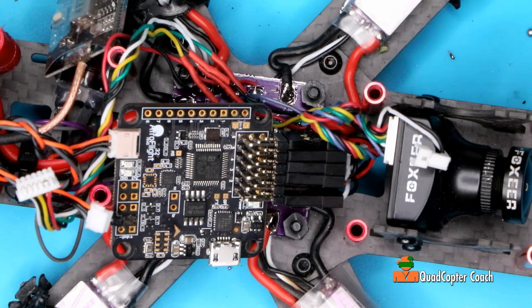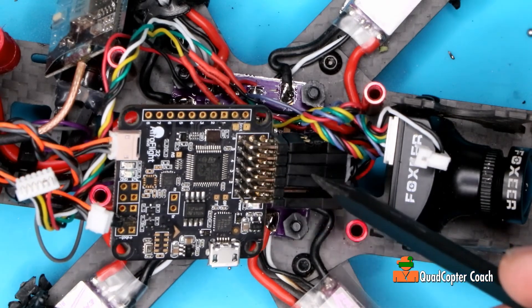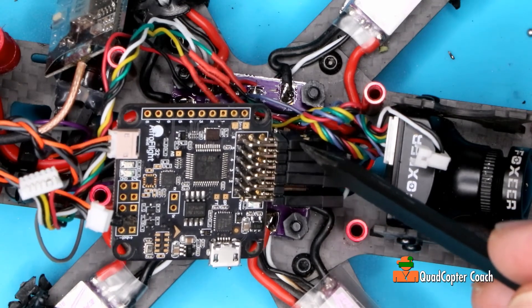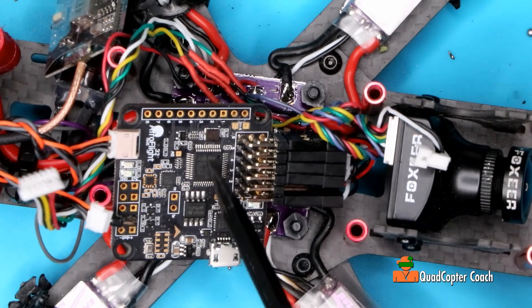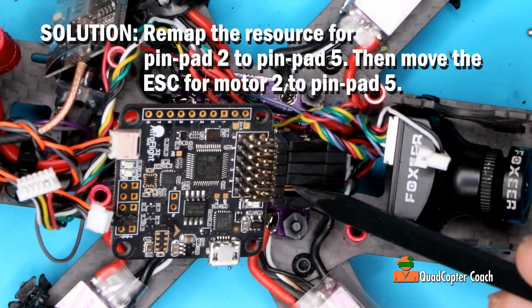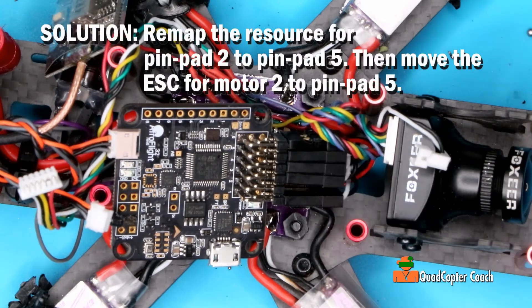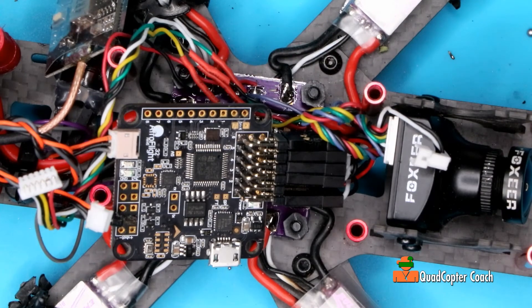So now I had to move motor 2 from pin 2 to another pin. I decided to move it to pin number 5, and I had the power connector on 5, so I moved the power connector to 6. This is a computer and a computer chip, so I reprogrammed it — I reprogrammed the resource to go from motor 2 on pin 2 to motor 2 on pin 5. When I did that, motor 2 spun perfectly. All the motors spun perfectly. That was the answer to the problem.